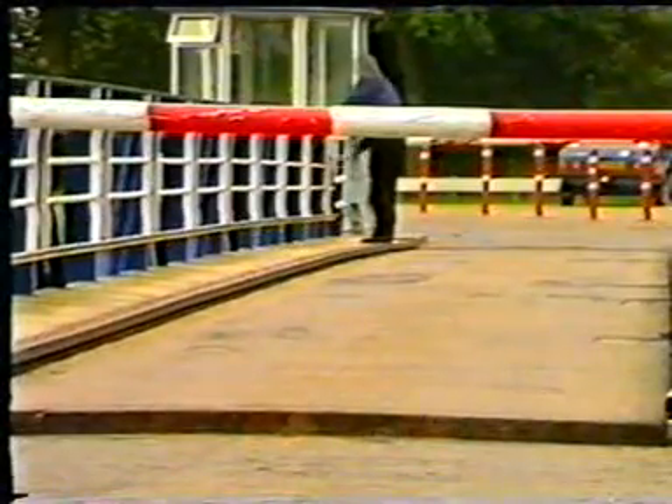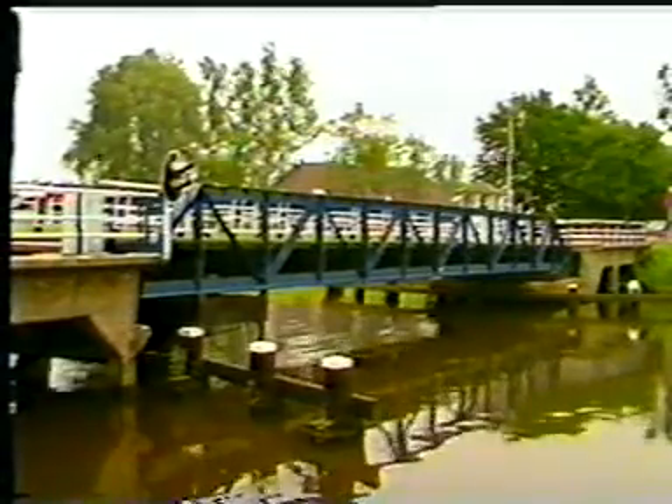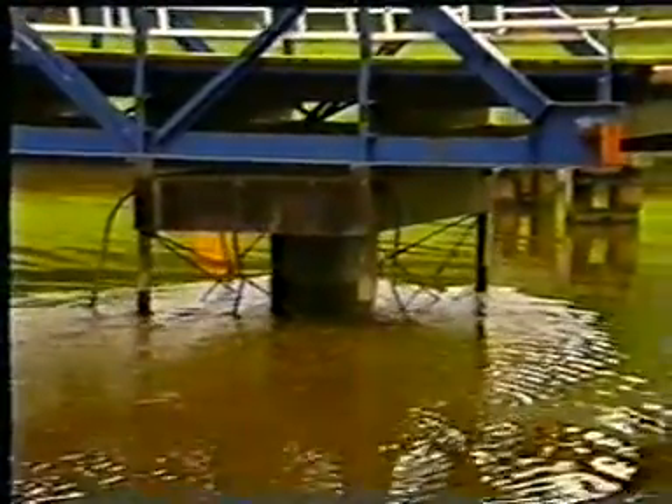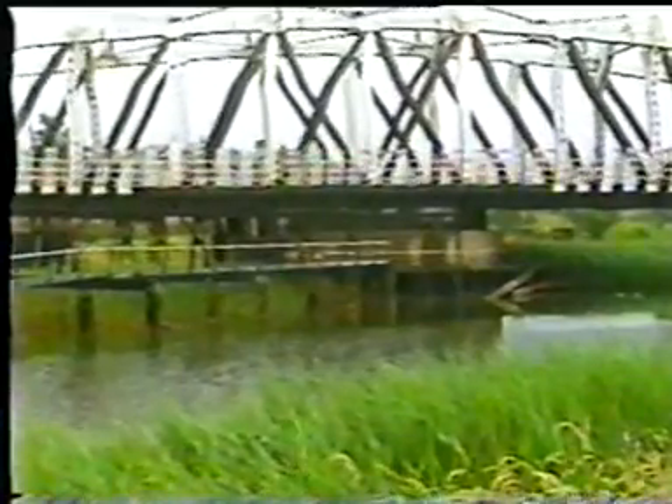At the lower flange, a bogey — including counterweight — is moved in the direction of the point of rotation. The nose of the bridge is lifted from the supports. The entirely submerged pontoon generates a constant upward pressure. Another application of a pontoon can be found in a swing bridge with a rim bearing. The pressure on the rollers, due to dead load, is reduced to about 30% by a pontoon in the pier.